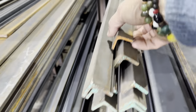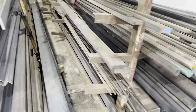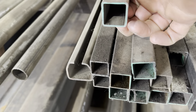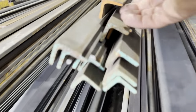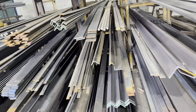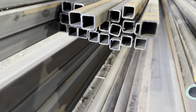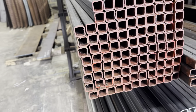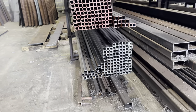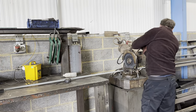I'm wondering whether I should go for angle iron, which makes it quite an easy base but possibly harder for me to weld. Or steel box - that one there looks quite thin though, maybe one mill thickness, whereas that's probably about three mill. That's probably a tad too chunky. That box there might be doable - looks like a thicker wall, maybe two mill. Oh now we're talking, that stuff might be right. That looks pretty decent, they've got enough of it. After some friendly advice from the chap here at Steelfast, I've settled on some angle iron.